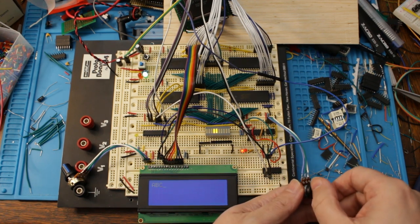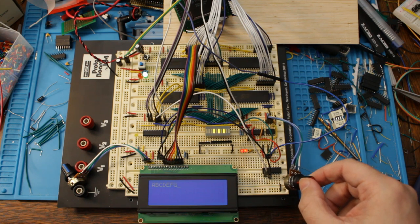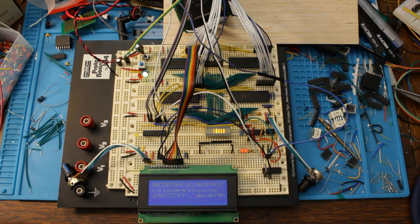Now B has appeared - great, it's all looking good. Let's turn the clock speed up. Yes, it works at a faster clock speed too - the letters are coming up more quickly. That's as fast as my 555 timer will go at the moment; I could make it faster by changing capacitors, but that's the limit of the potentiometer. It's ploughing through all these extra characters the LCD panel has, filling the first line then the third line, then going back to the second and fourth lines. That's because this four-line LCD is internally treated as two two-line displays - line three is actually a continuation of line one, like a two-line 40-character display.